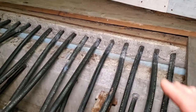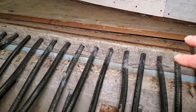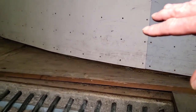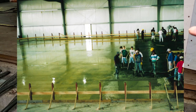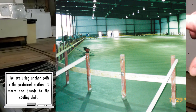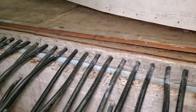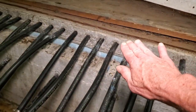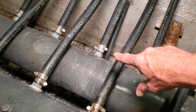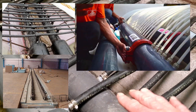Anyway, so you've got a cooling slab right there — it's about four to five inches typically. Our cooling slab runs a little bit wider than the ice rink. Our posts are concreted into the concrete, so we don't have a modular system or ice dam or anything. Basically what you have here is a floating slab of concrete — it's separate from the concrete slab in the hallway and where the player benches are. This cooling slab contains, from what I understand, 186 tubes going out, and 186 tubes coming back to the return header pipe. So you've got two six-inch header pipes and then a bunch of one-inch rink pipes going into the cooling slab.